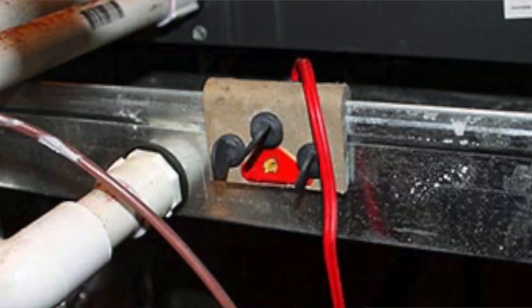I'm a big believer in float switches. Every time we put a secondary drain pan in, we'll put a float switch on it — but float switches fail. A lot of companies, instead of putting float switches on it, will put a secondary drain off of that secondary drain pan and usually put it in a location where if you saw that dripping, you'd know there is an issue.